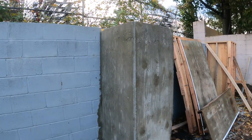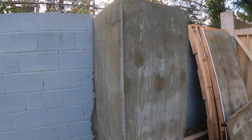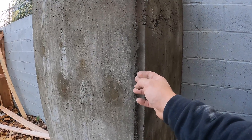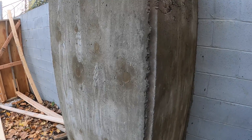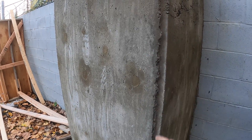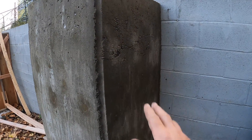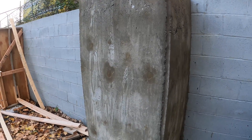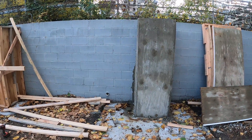All in all, it's not too bad. There's a little bit of honeycomb in here, but otherwise it's pretty smooth. On this side, since it started to bow out, the cream of the concrete made its way around the little corner strip we had in there, but I think I'll be able to clean that up with a grinder wheel. A little bit of honeycomb — really, it's not that big of a deal. Standing back, it's pretty square.